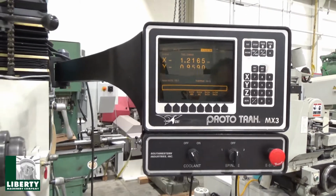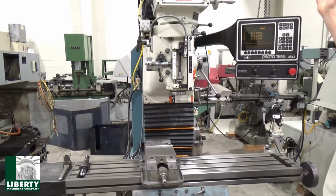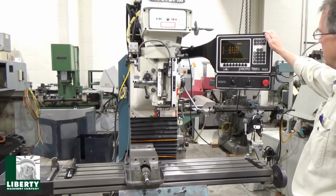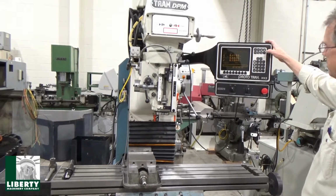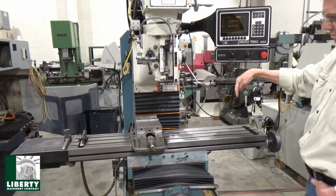It goes to its fixed position, then it's gonna ask me to load tool number 2, diameter 312, 5/16, so hit go on that. And you kind of see it, we can speed up the feed a little bit because we're not really cutting anything here, so going a little bit faster. And this one's just doing a little bolt hole pattern.